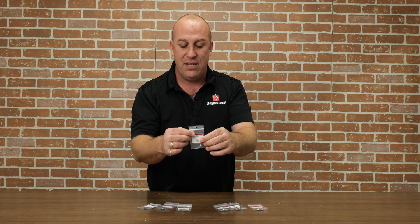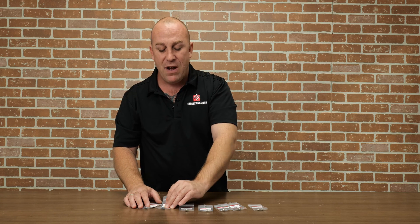Moving on to their regular brass plated wear resistant nozzle — they make these for different companies, and you can get these for basically every printer. Then we've got their A2 steel. Now all of these are coated as well, so keep that in mind. And then we've got their M2 steel, which is high-speed steel.